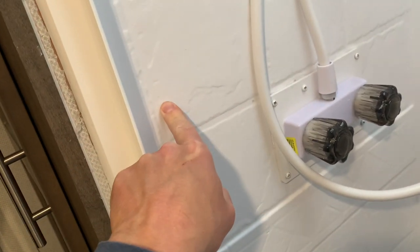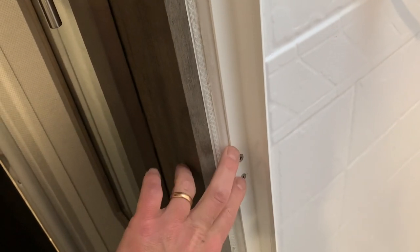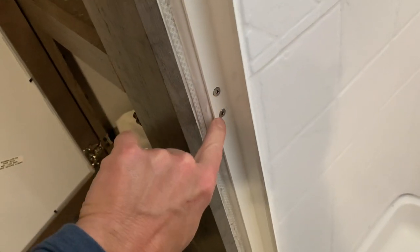The retractable unit was also only held on with double-stick adhesive, but since the shower wall isn't very structural I wanted stronger support, so I put two more one-and-five-eighths inch stainless steel deck screws in. However they basically go through a piece of quarter-inch plywood which doesn't give much structural support. So through my access panel I fished in a piece of three-quarter-inch plywood as a backer to screw into. That was a bit of a pain because you don't have any leverage to hold the plywood, so I had to pre-drill those holes and counter-set them. When taking out the shower I peeled off some of the wallpaper-like material on the plywood — unfortunate but I could go back and paint it.